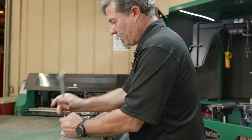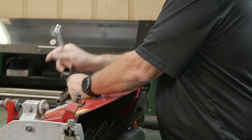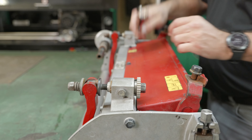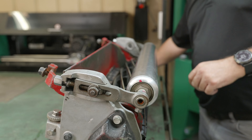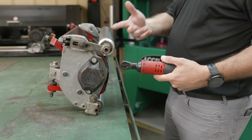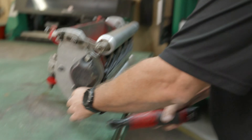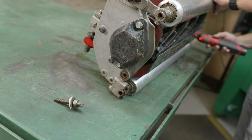On a DPA, the first thing we're going to do is loosen these nuts up on the back — 16 millimeter wrench. I'm going to back off the reel to bed knife just one half turn, usually enough. And then I'm going to remove the bed bar. Righty tighty lefty loosey — don't forget. I've only been doing this 28 years and I still get confused left to right sometimes.